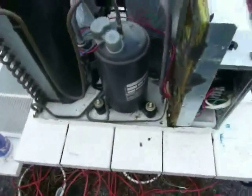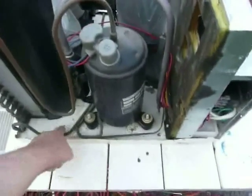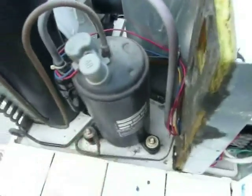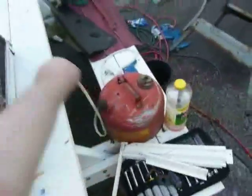You can see it's much, much cleaner inside here now, which is important because as this unit sweats off the evaporator coil, it's going to fill up with water in the bottom, and this does a couple of things. First of all, it's going to help the unit shed heat — there's a set of refrigerant lines running along the bottom there that get soaked underwater. It also helps keep the compressor cool, which is very important. After you're done cleaning, it's time to look at the electrical aspects of the unit.